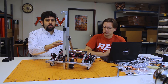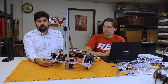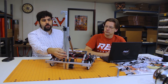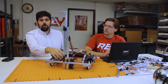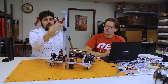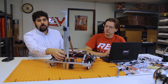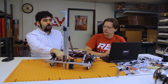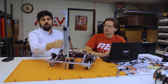We worked on the mechanism that would be used for latching and deployment in the match and we bolted it on to one of our generic demo platforms. Basically what we used was one of the Rev Linear Motion Kit V2s, which is actually all you needed for this, and three pieces of extrusion. There's a little bit of optimization that has to happen in regards to length and how much it moved, but because we're just prototyping we kind of just put something together. We have it in a configuration with a core hex motor on the bottom, which pulls this down, and then a piece of surgical tubing so that the center piece or the hook is spring loaded up.